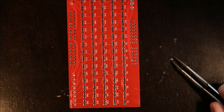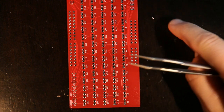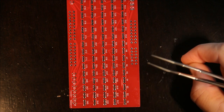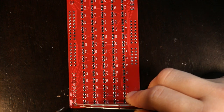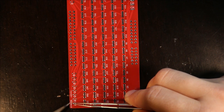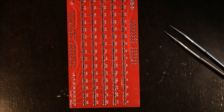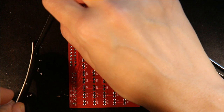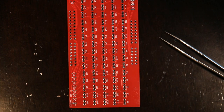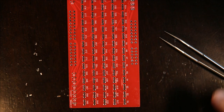And because these are resistors, they can be white side up or black side up. But since I'm working on a prototype here, I like to keep the resistors with the number side up so that later I can change them if I decide the lights need to be brighter or darker, etc. Now I don't have to unsolder them to figure out what size they were.